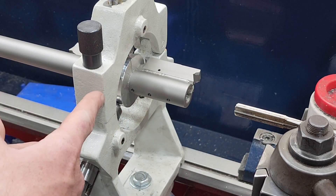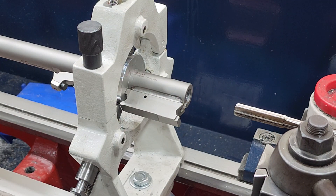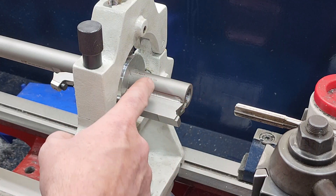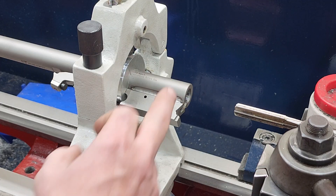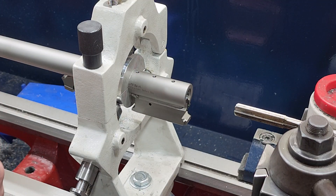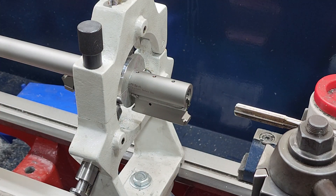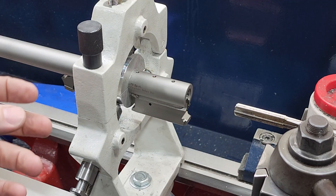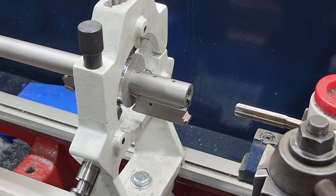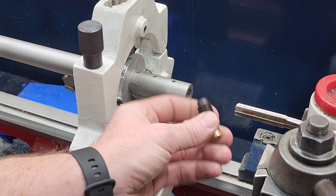After I did this — this is kind of an old-school way of chambering barrels in general — this is down to less than one thousandths runout in the front and the back. The back is actually a little better, and the front is about eight tenths. For this project, within a thousandths of an inch in the back end, that's gonna be good enough. This is not chambering dimensions — we're not trying to get absolute accuracy. If we're a thousandths or under with this breech plug, that's gonna put our flash hole in the very center, and that's what we want.